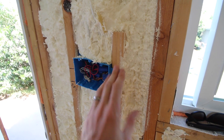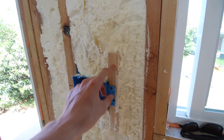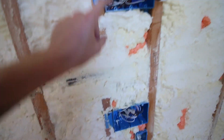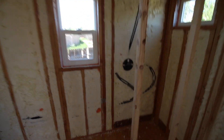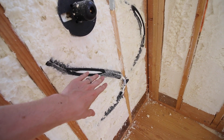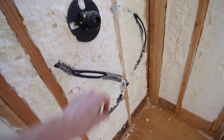Back at it again in the tiny house. I'm going to fix a few things today. First, I need to get this box pushed back into the wall — the spray foam got behind it. I should have put a screw through this piece of wood into the sheathing so it wouldn't have gotten pushed out. I also need to get these pipes back into the wall; I should have secured them better into the cavity so they wouldn't have been pushed out during the spray foam process.